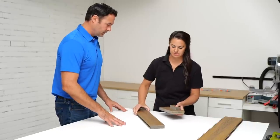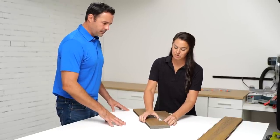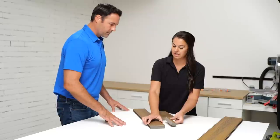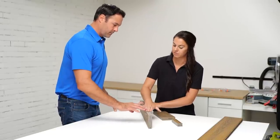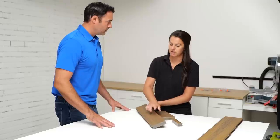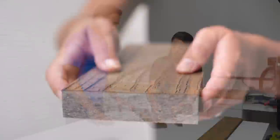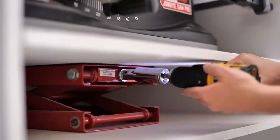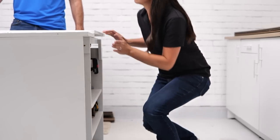The first step in this process is to make the deck boards not look like deck boards. To do that we're going to be ripping off one edge of our frame pieces so this ends up being four inches wide and has a nice finished edge for the top of our chair. We can apply stain to this too so that it matches the face color. For our legs we're actually going to rip off both sides and that'll give us a more finished look. We can set our table saw up for four inches, raise it up, and make some cuts.